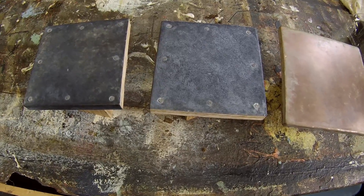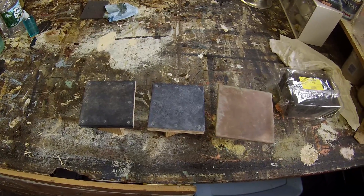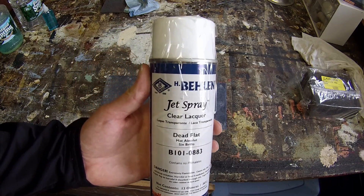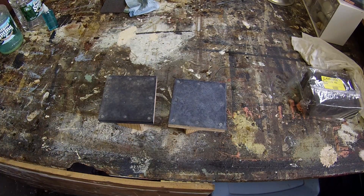For a sealer coat you can use lots of things — you can start directly with wax, apply polyurethane, or spray on a clear coat of enamel or lacquer. The product I'm using is a flat lacquer that I buy from Grizzly Industrial. It's been working well and doesn't show a lot of gloss, which isn't desirable for the type of finishing I do. I do one or two coats of clear lacquer, then apply wax over that — and that's my finishing process.